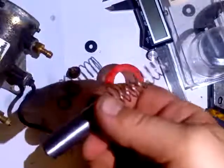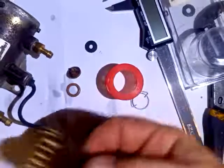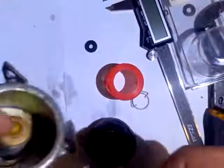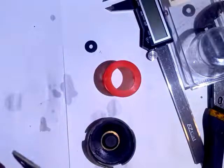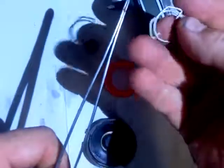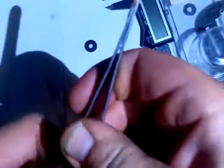It's just a smooth bore — it doesn't have rings or anything. When you first disassemble this, the plunger is going to be inside here. Then there's a little poppet, and there's a poppet on the other end of the spring as well. Then there's a washer. Push all that in there, and if you do it right, that Viton gasket — yours will have a brown rubber gasket — it'll want to pop out on you. Take this and put it over the end, trade hands, and slide it down.